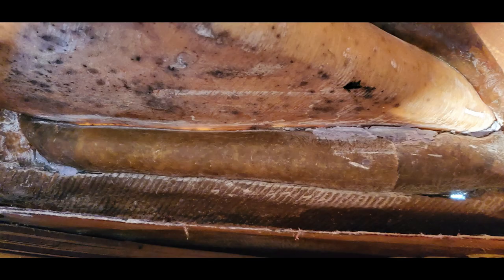It really looks like it was just poor planning on their part, and it wasn't a good follow-through on the design. It worked for a while, but eventually it failed, and the only thing holding it from leaking was the gel coat and Boat Flex and all that stuff. And the gel coat with no fiberglass behind it eventually just broke away and the water started coming in. And on the exterior side, it is actually inside the cockpit area of the boat. And that's where the moisture was coming in from.